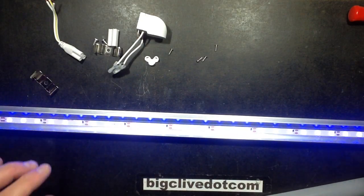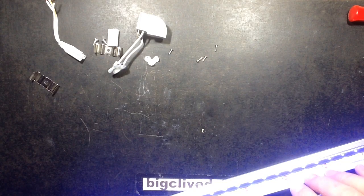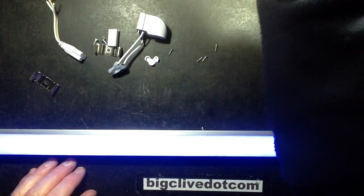In goes some blue LED tape — just 12 volt stuff. Even without the diffuser that's quite a sharp effect; it really looks quite nice in the aluminium because you get reflections on either side making it very flat and straight. Let's see how the diffuser looks — it just slides into the groove and that diffuses it nicely. You can see a slight patterning, but it's quite nice. It's not super bright because that is low-power tape — about 200mA at 12 volts — but in an entertainment environment or a club that would look very nice as a visual effect.